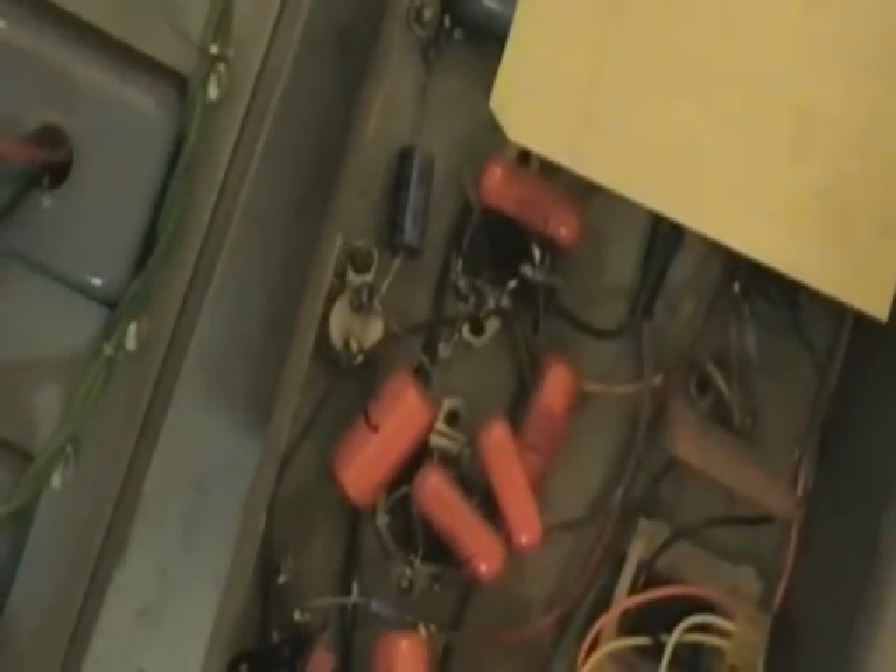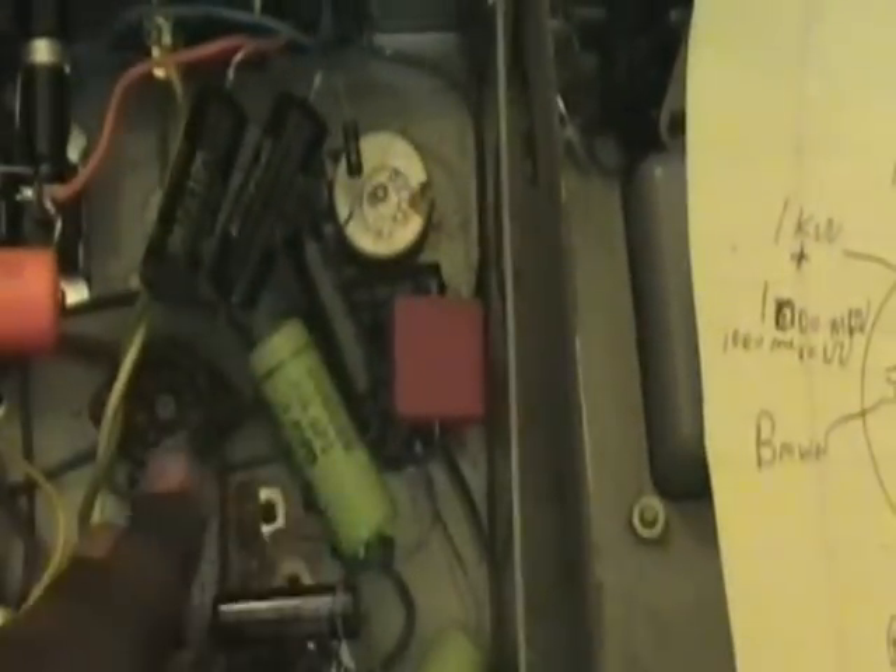Here's another amp. What just fell out was a capacitor. I'll put a new one of those in there and may recap this one — put new capacitors in there. I'll test them and check them out. Sometimes I'll change out the bad resistors. Here's a job that I've done — you can see the orange drop capacitors I put in this one. But I'll do a little bit more work on all of these amplifiers before they're ready to go.